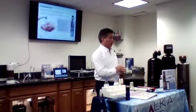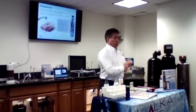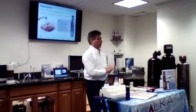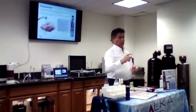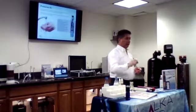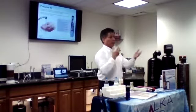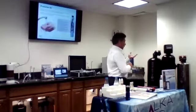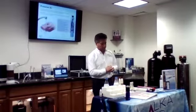And that will be something that, if you are talking to the customer, you can get all this information. And it will be nice to also know the area, and we will figure out the hardness, how many grains of hardness that area has, and we do the calculations. And the planner also does the calculations for the hardness of the system.